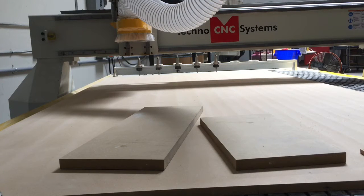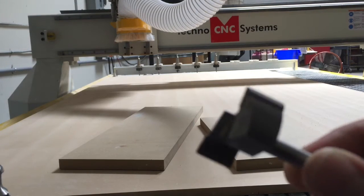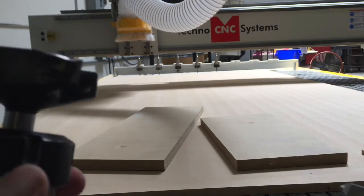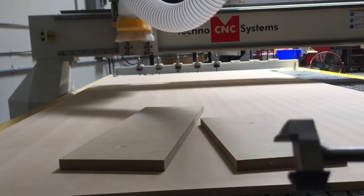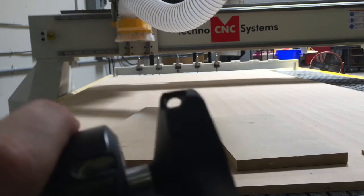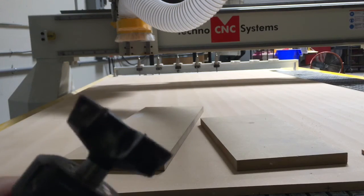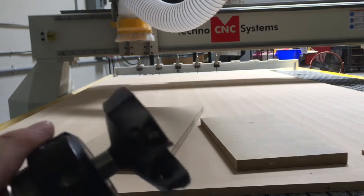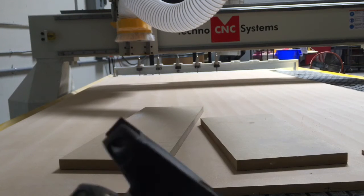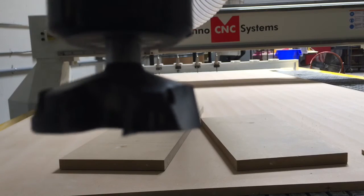To recap: in the past I was a big fan of the one and a quarter inch bits, mostly because of the price — about 40 bucks — and I'd give these to customers as a no-charge gift when ordering a machine. But now I'm moving over to the larger tool; there are just too many advantages. The smaller one cuts a four by eight spoil board in about 10 to 12 minutes, while the larger one does it in under five minutes — a huge time savings. More importantly, the smoother finish results in more efficient cutting and better hold down. Nothing worse than having a part move on you and having to recut it. It's a great tool and I hope this tip helps.